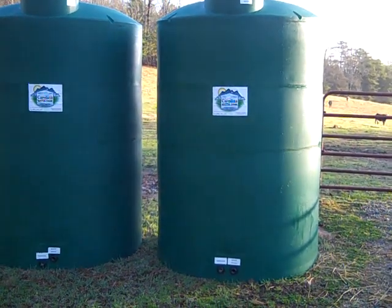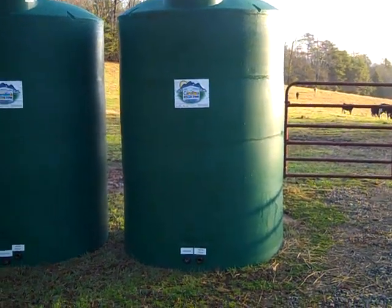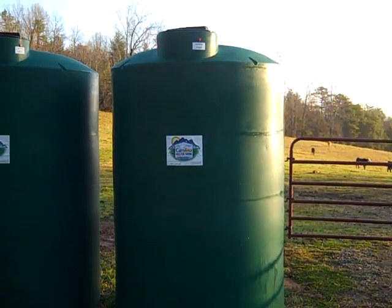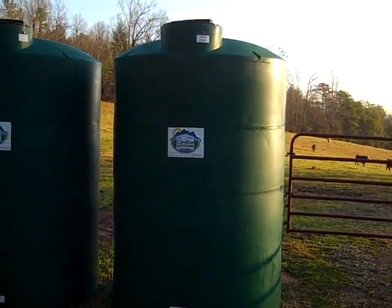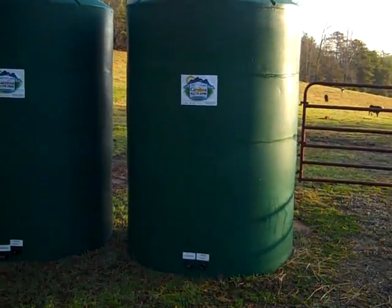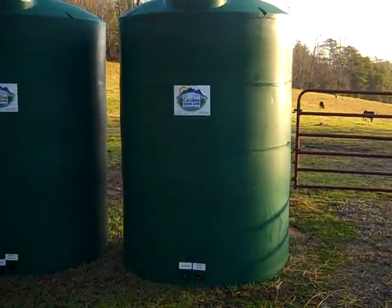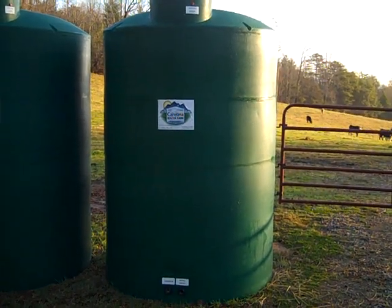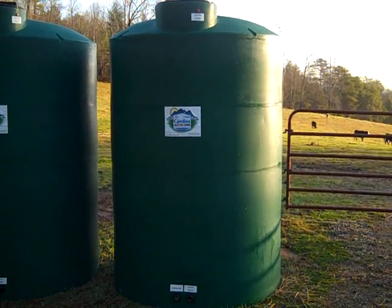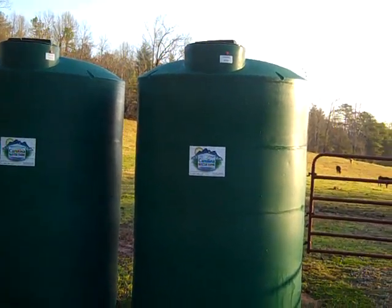These are the tanks I've settled on for several reasons. They're a tall tank for an above-ground tank, and I like that because in many cases the homes I encounter are at the top of the property elevation-wise. In my two-phase water pumping systems, I pump water into these tanks, and there's enough head to get water into the house. With solar and storage you can at least flush commodes and have water at the sinks — you're not going to have great shower pressure, but at least you have water without hand pumping.